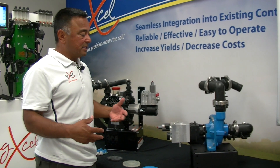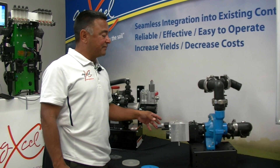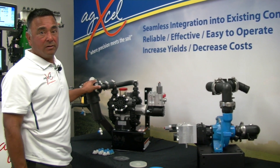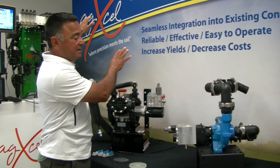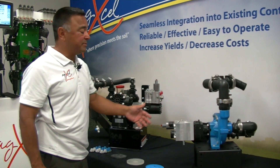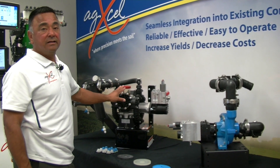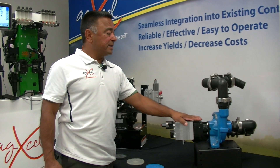The centrifugal does a great job, but its drawing capabilities require help — it's not self-priming, so you have to help prime it. The tank needs to be mounted high with the pump below so liquid can drain into it to help get it primed. With a positive displacement pump, it doesn't matter where the tank is, because it draws the liquid in extremely well.